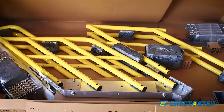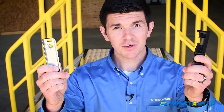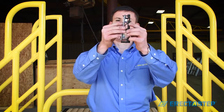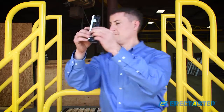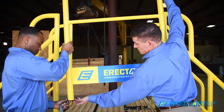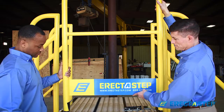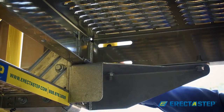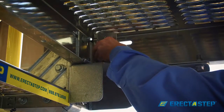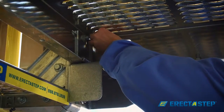For time purposes, we have assembled and bolted up the second stair unit exactly the same as the first. Now that we have two sets of steps and a platform assembled, it is time to move on to assembling the handrails. We will need the slide rail insert that is included in the handrail kit — the slide rail insert needs to be oriented with the steel plate side facing the platform. A quick tip: use tape to hold the inserts in the handrail and in the correct orientation while bolting the rails onto the platform. We will need to use a backer plate on the inside of the platform, between the bolt and the platform surface. Tighten down the bolt to secure the handrail to the platform. Repeat the process for the other handrail.